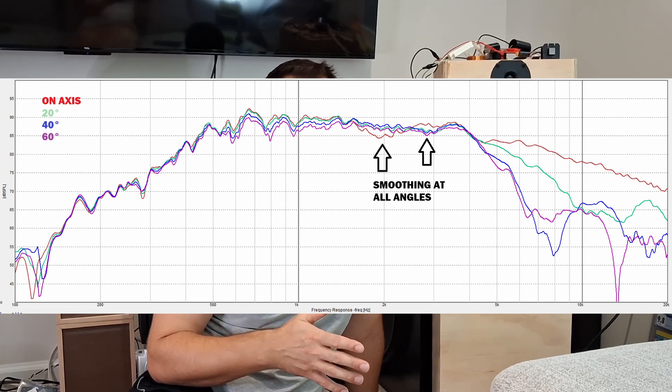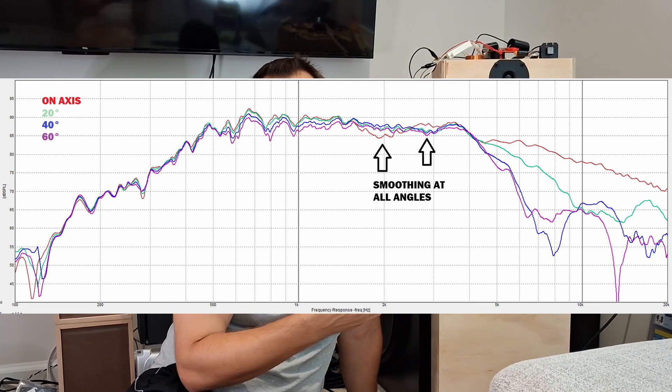Let's just say I'd rather have a uniform off-axis response than an offset mid, because I'm usually never listening exactly on axis — especially in a home theater room where there are multiple seats. We saw in the measurements that as soon as you go off-axis, the diffraction clears up. So I think that's why it doesn't bother me. And overall, the lesson learned is: even though it looks big on the frequency response, it's not that big of a deal actually. And this is why we need to take off-axis measurements as well and really evaluate what the entire story is.